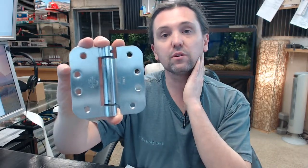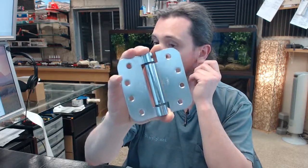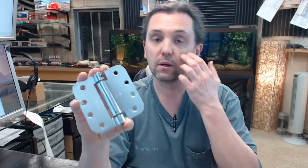LB means lube bearing. It's a maintenance-free, sort of concealed, self-lubricating bearing construction specific to Bommer. 4312 means that this hinge is a standard residential spring hinge, meaning that the screw hole locations are in the regular, standard, common pattern called a template pattern, meaning they're not what some people call zigzag or made for a specific door manufacturer like Republic or Castlegate or Peachtree.